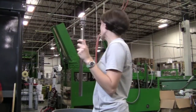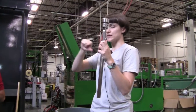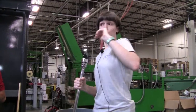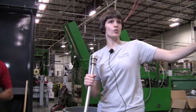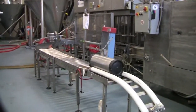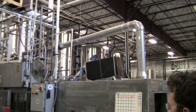This is also, by the way, a large version of what we use for bottling. They just have little filling spheres, but they look just like this. When we were doing kegs by hand, we could do about 5 per hour. This machine can spit out 1 every 75 seconds. So significant improvement in speed. It's basically just 5 different stations where they do each one of those. They add the acid, the caustic.